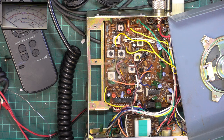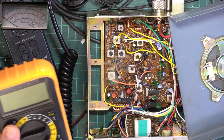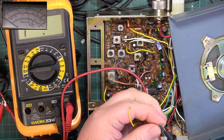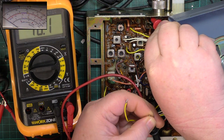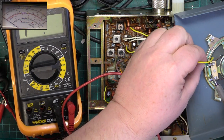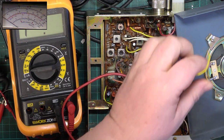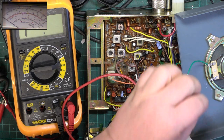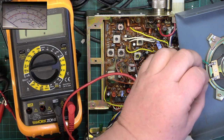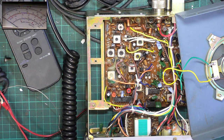So he suddenly discovers that the remote control doesn't work. Now, bear in mind this television didn't work, so you couldn't test the remote control because the telly didn't work. So he then discovers this remote doesn't work. So he starts taking this remote control apart. And most of the time, it's an ingress of somebody's coffee in the remote control keypad. So it's just stripping it down, cleaning it with isopropyl alcohol, putting it back together. So it's just stripping this remote down, and this bloke comes in.